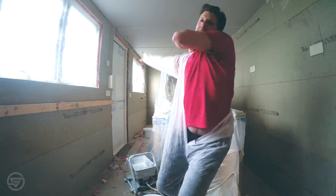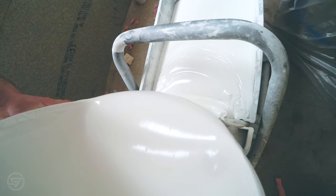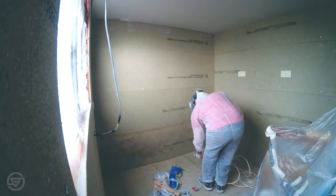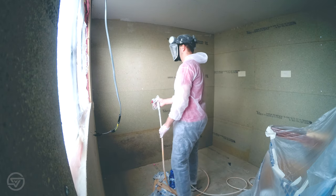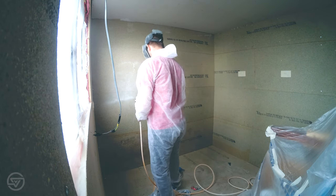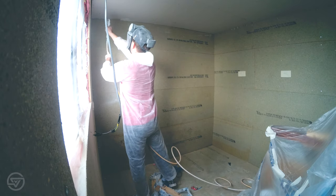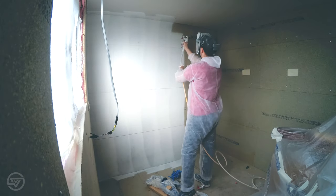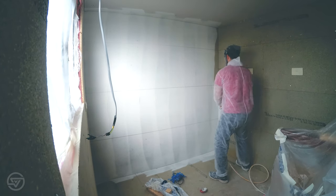Spraying paint is a very, very messy job, so I had to make sure that I covered up as completely as I possibly could. Another major point I'd really like to tell you all about is to use a forced air respirator — and that's really in any kind of dusty environment or if you're painting. Because if you just have a face mask, you are actually still pulling particles in around that face mask. Whereas a forced air respirator is sucking air in with a little electronic fan through the respirator, clearing out all the particles and pushing air so you've got positive pressure inside the mask. So at the end of the day, I'm not pulling little bits of paint out of my nostrils. It's all clean air and that makes a huge, huge difference.